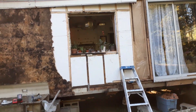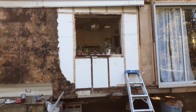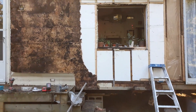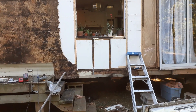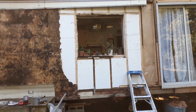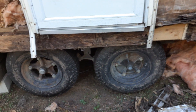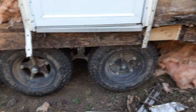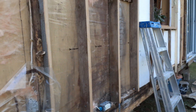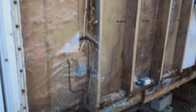I've moved on to the next section and got the window out. There was styrofoam I put in previously — I think I'm going to leave it to add an inch and a half and put the styro aircrete up against it. The top plate of the window is totally rotten. The plate underneath the door is in bad shape too, but fortunately I have another 2x6 to replace it. Since I've already added an inch and a half, I've ripped some spruce boards into four inches and just tacked them to the old studs that were in rough shape.